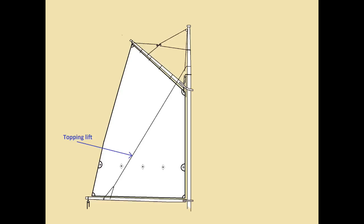The final piece of rigging peculiar to a gaff rig we should talk about is the topping lift. This will be necessary for setting and reefing the sail. Bermudan rigs also have topping lifts, but with a gaff sail, you're faced with the problem that there's really no way to run the topping lift outside of the sail, unlike a Bermudan rig where you run it from the top of the mast to the end of the boom. So with a gaff sail, you're going to want to have two topping lifts on either side.